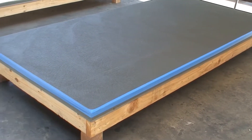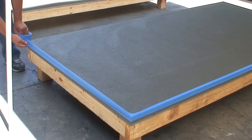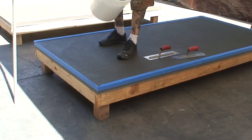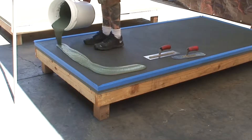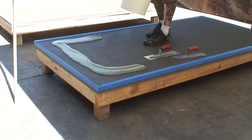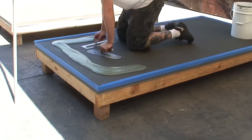Combine one 50-pound bag of LD1 cement with 4 gallons of 1589 modifier. Mix until uniform using a low-RPM, one-half-inch drill with mixing paddle. When mixing smaller batch sizes, measure one part of LD1 cement to one part 1589 modifier by volume.